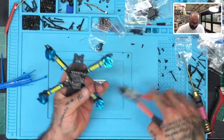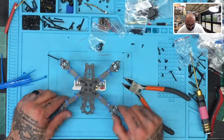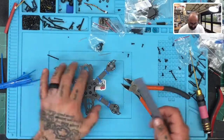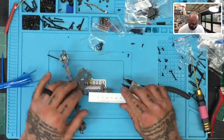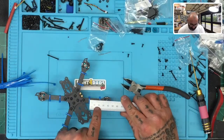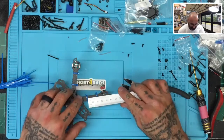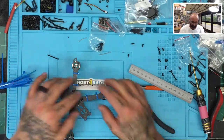And what I'll show you next is this. So if you turn this over, you're going to see that every piece should be identical in the way it's put in. Okay. And then for the tolerance, I usually, and this is where I'm probably going to get myself screwed because I can already tell that there's one because the heat shrink wasn't the same size. But let's just say for the heck of it, the gap between the two is 20 millimeters here. The gap between the two is 20 millimeters there. Gap between these two is about 20, almost 21 millimeters there. And the gap between these two is the short one. So that's about 19. I said I like to keep a 2 millimeter fault tolerance there.